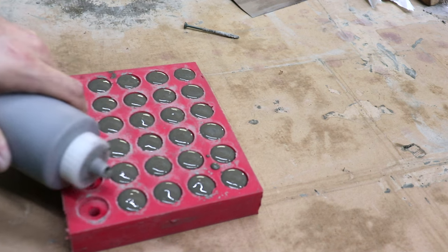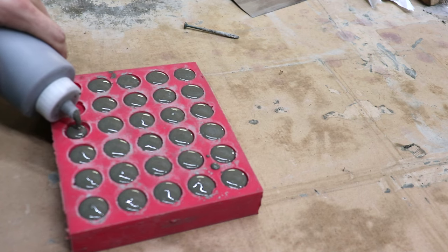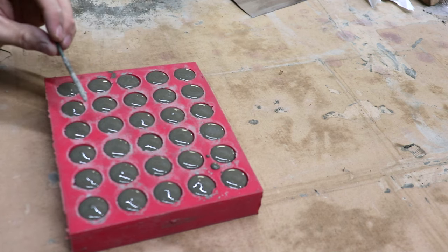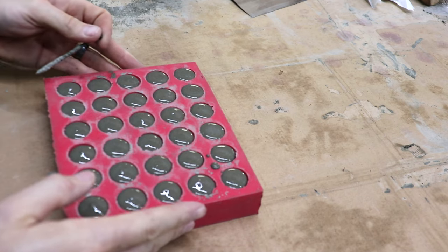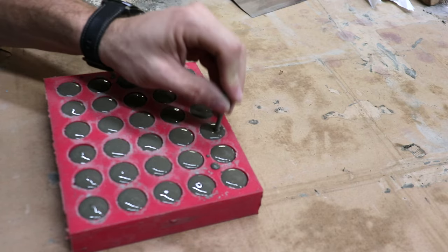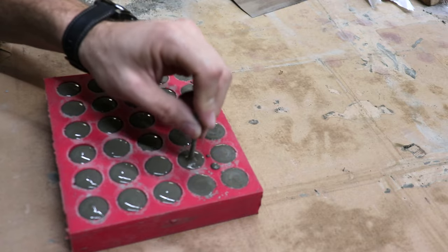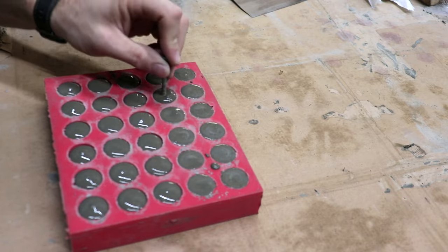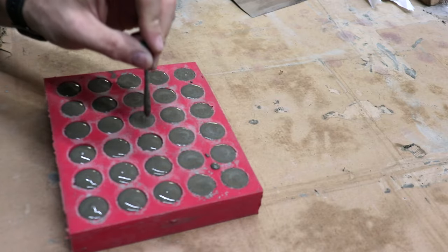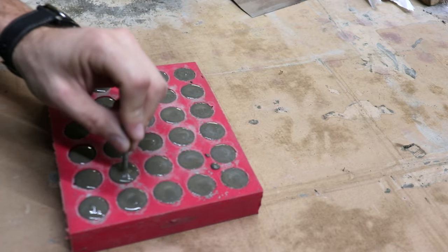So it's a very simple, straightforward process. You're going to pour your mixture into the mold, and that's another reason why I got away from the sand, because you just couldn't get a consistent plug. So you fill your mold, your plug, all the way to the top, and then I come back with a little screw, and you just kind of swirl it around in there. And what that does is it mixes the cement in the hole so that there's no bubbles in there, and then it all solidifies as one piece. Because when you demold these things, if you don't let them sit in the mold long enough, and you try to pop them out, you're going to pop the heads off and you're going to lose the stems, and you're going to end up with a little stem and a disc, not really a frag plug.